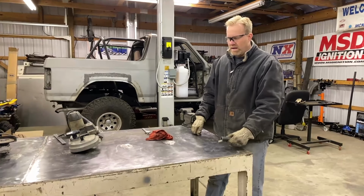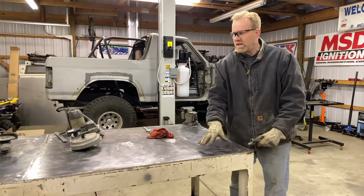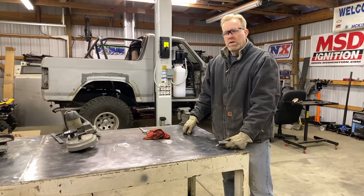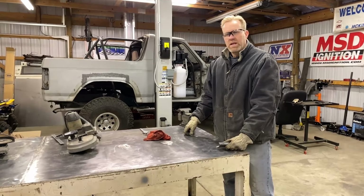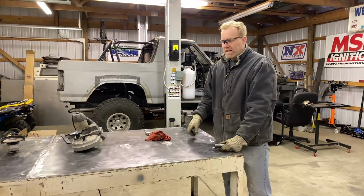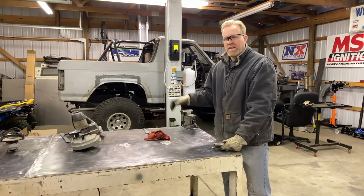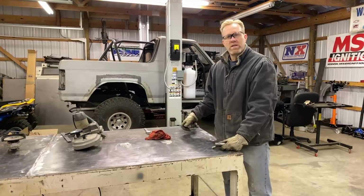I'm gonna use my 6 foot workbench, and I'm gonna mount it to the bench. It'll be removable, so then I can stand it up in a corner. I'm gonna use some 3x3x3/8 carbon steel angle. I got some 3/8x6 flat bar, that's what I'll use for the mount. A couple round bar and some different things. But a lot of it is just stuff I've had in the shop, or I bought a couple of pieces of angle that wanted to be a little stronger.